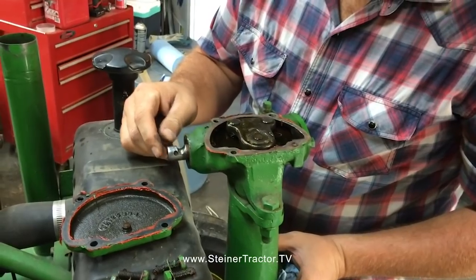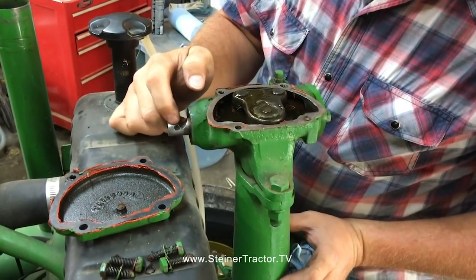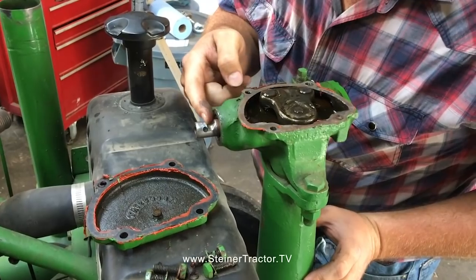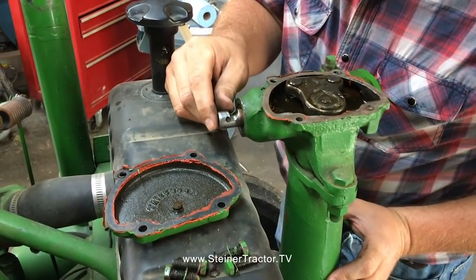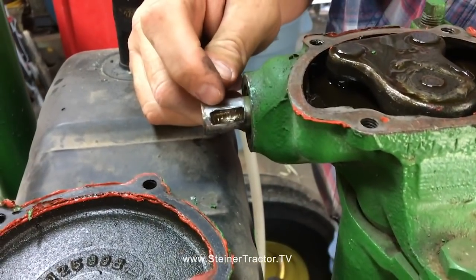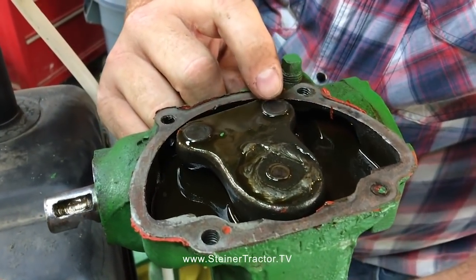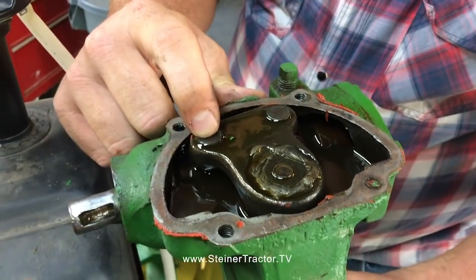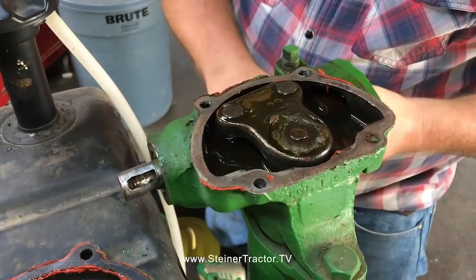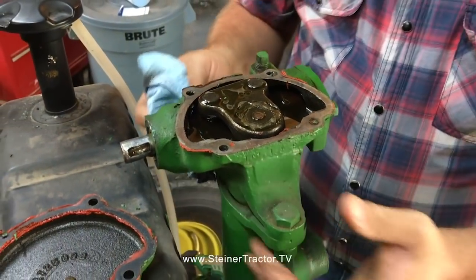So what we found upon taking our steering shaft loose from the worm gear, somebody in the past had tried drilling a hole through the coupler into the worm, which they found the worm to be extremely hard. This little notch that's in the worm gear is all rounded out, and that's probably just due from being loose. The actual keyway itself is just extremely worn and wallowed out. You can maybe also see the pins are actually loose in the steering arm. Both pins are loose. So surprisingly, though, there's still oil in the box, which is really quite surprising to find. Maybe somebody's replaced the seal and bushing in the past. So we're going to go to work draining the gear lube from the box and then disassembling it further.